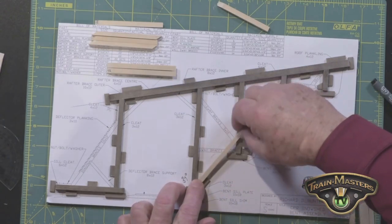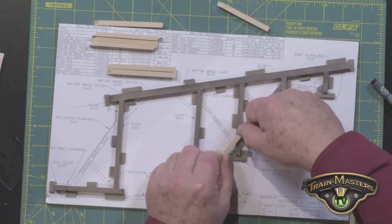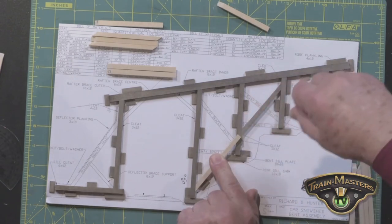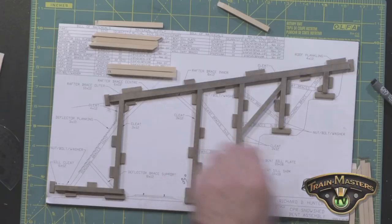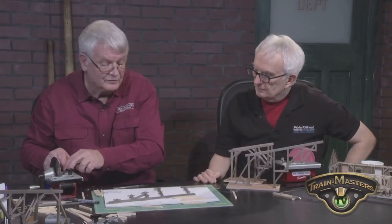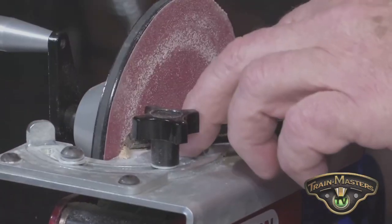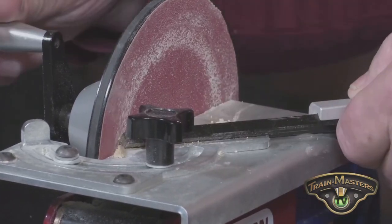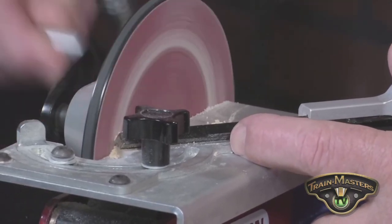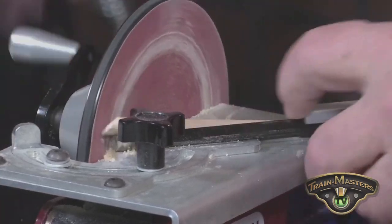I've taken the liberty to make another one. We've done our 37 degrees. I've cut these off fairly tight in length, because if it's out here, you're going to be sanding for half an hour. Right. So you can just lay this on your drawing, mark it, cut it on the chopper, and again, make sure that you get the angles going the right way. Right. So now again, you can use this part for the initial cut. You can use that part just as a push stick.